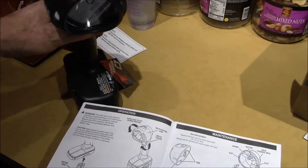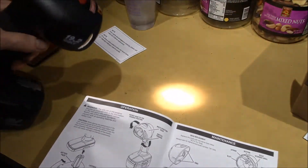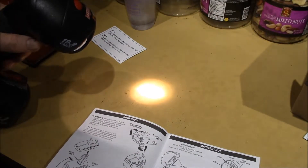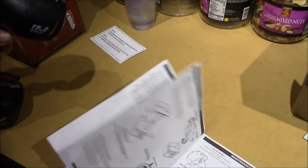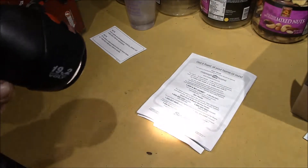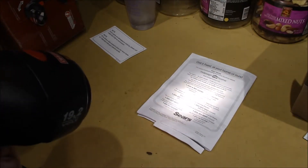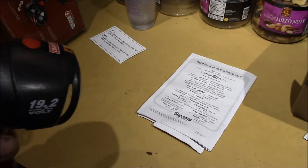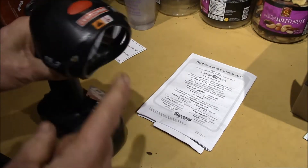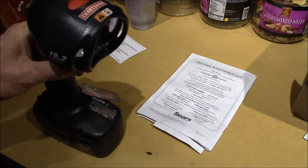It's a 19.2-volt, 600-milliamp, 12-watt bulb, and I'll be going down to 1 watt - so I should get about the same light output at about a tenth of the power. I actually wanted to get a higher-power bulb, but in the 26-volt range they only make a 1-watt. They do have higher-wattage bulbs but those only go up to about 12 volts.